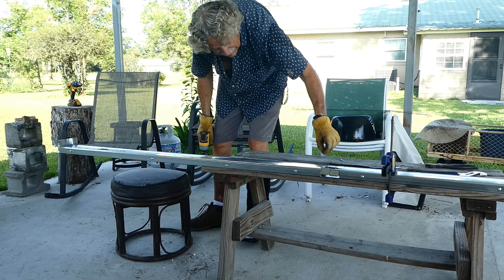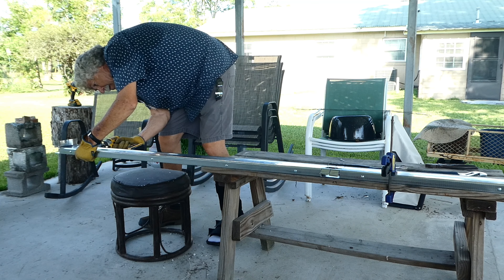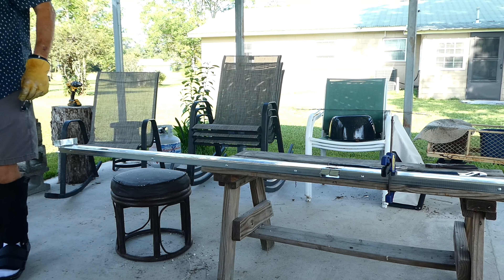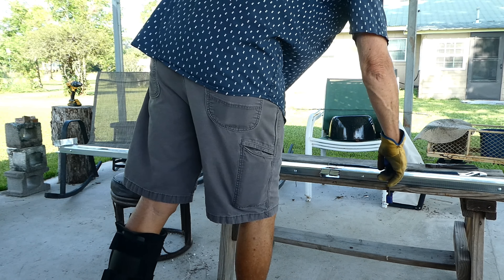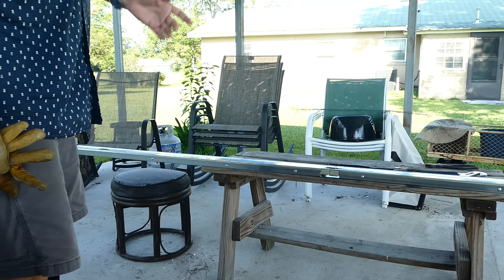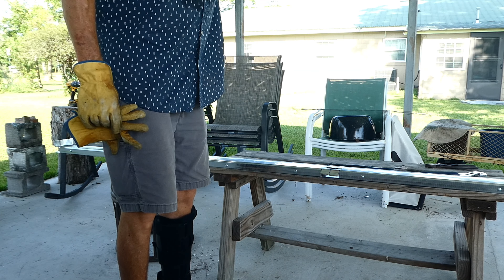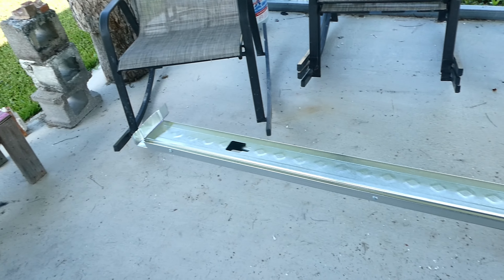Because we're going to come back and put a ceiling in this shed — barbecue shack — that's to protect the foam from any hazards. Now that it's folded together, we don't need to clamp it anymore because it'll lay flat. Until we cut these two center pieces, that's when it'll want to bow on you — that's why we leave them together until the last thing we're going to do. Now I'm going to go down to that end, make my fold, and then come back and cut it so it's ready to go on.